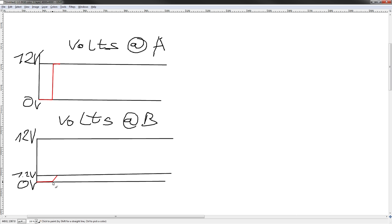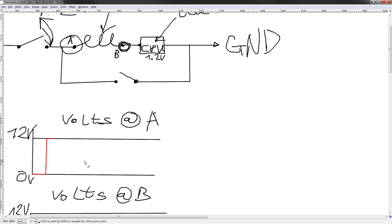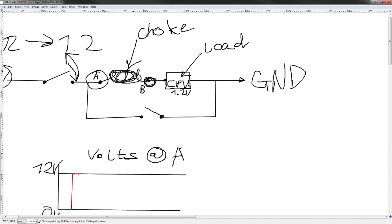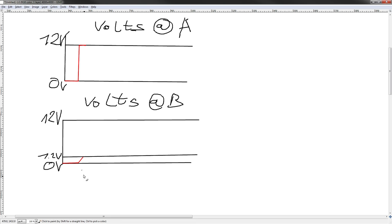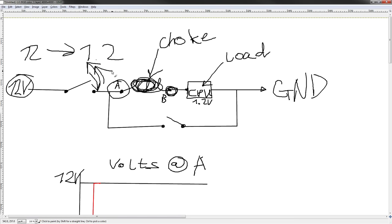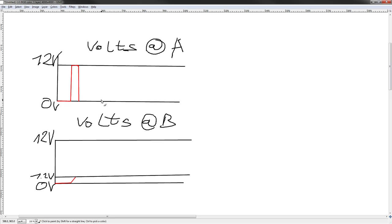If there wasn't an inductor, you'd just get straight 12 volts right off the bat. So inductors basically limit how quickly the voltage can change depending on their inductance, which tells you how big the maximum magnetic field they can hold basically is. We've now built up a magnetic field. We've charged up the inductor to the point where point B is at 1.2 volts, and we don't want to go above 1.2 volts because that's what we want to run the CPU at. So we have to turn off this switch — we open it — and that's going to mean that at point A we're going to get this gigantic voltage drop and it's going to fall straight to the ground.